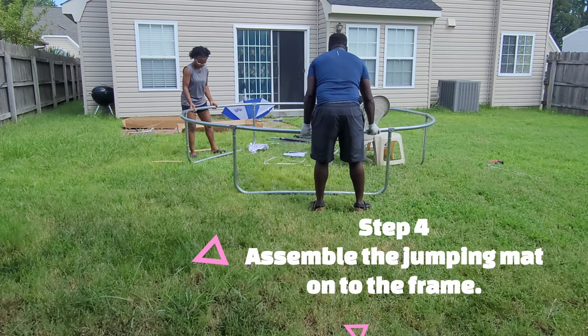The lower support pipe has 2 holes on one side, while the upper support pipe doesn't have any. That's the way to identify which pipe goes below and attaches to the legs, and which one goes above that extends the pipe up more. Insert the lower support pipe into each upper support pipe. Attach 6 support pipe assemblies and 12 brackets to the frame, and then screw 12 M6 75mm carriage bolts, 12 washers, and 12 M6 lock nuts by using 2 wrenches.